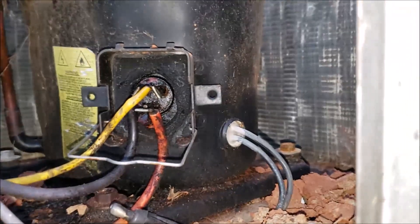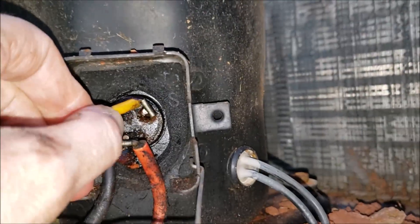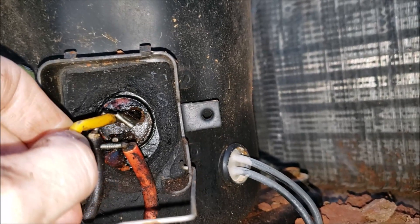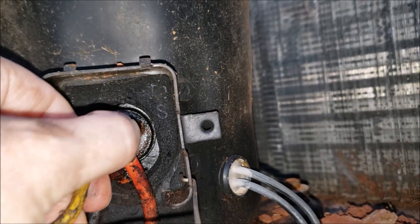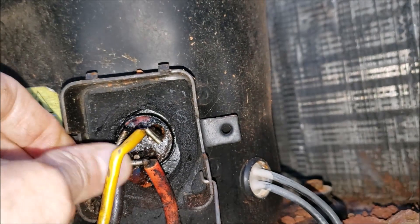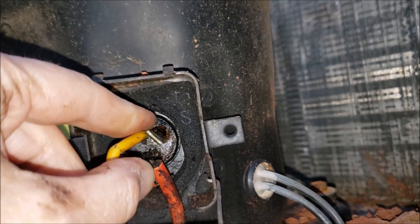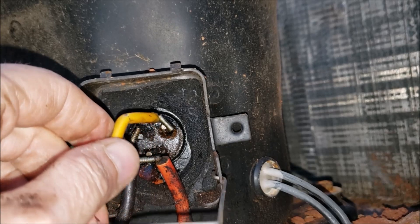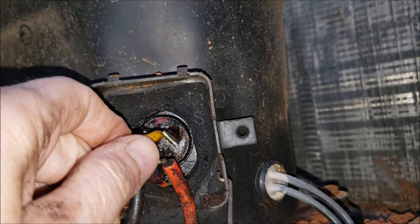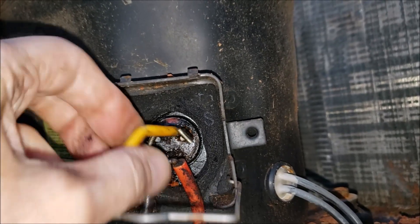I got a better shot now. I took the side cover off so you can see what happened to this compressor - I've never seen one do this before. See how the terminal blew out of it? That's pretty wild. That sure does mess up a compressor when that happens. The connection is still tight - it's just however they used to seal it has failed. This thing was from 2008, I believe. Nothing lasts forever though.